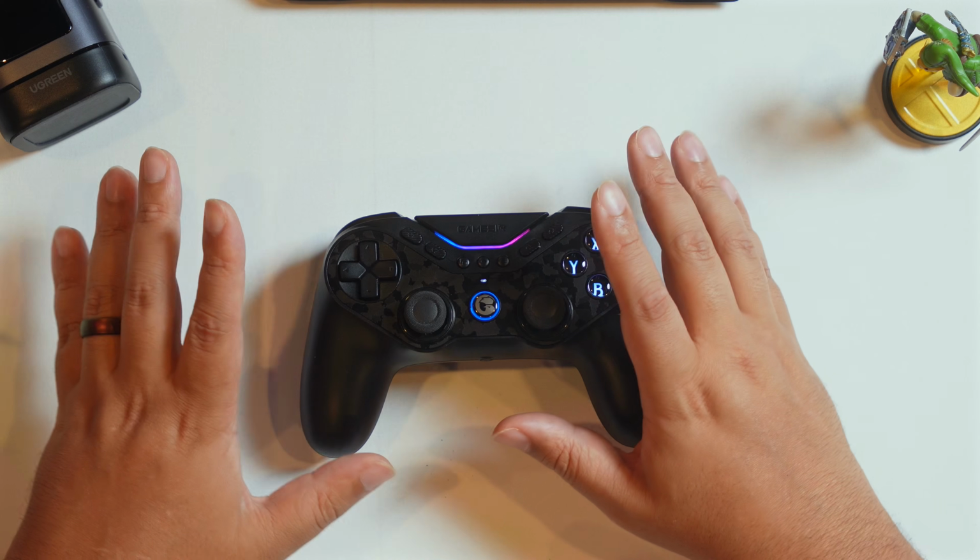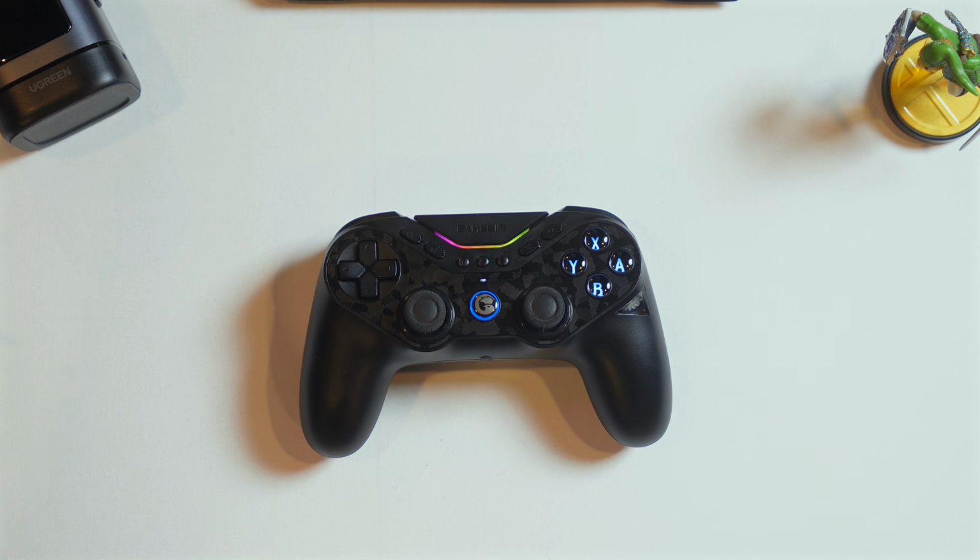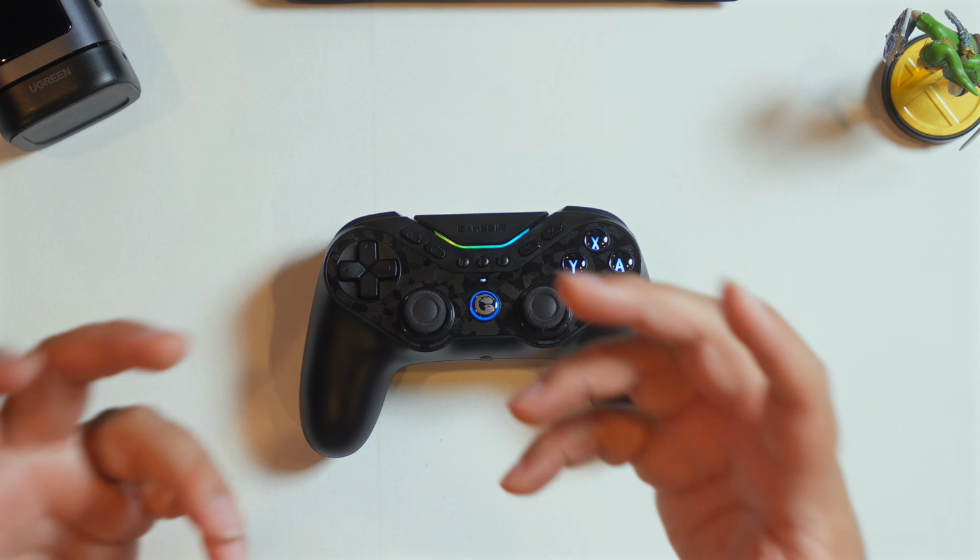Technically, it uses magnets, the exact same thing. But in terms of the triangulation of the magnet being read by the sensor, what you get is a very linear approach, a very linear growth to your sticks. Think of it this way. You know cell phone towers? How they triangulate your cell phone and they can know ballpark where your cell phone is? Well, imagine Hall Effect and TMR being exactly the same thing, but TMR has way more power, enabling your sensor to pinpoint exactly where you are with a much higher degree of fidelity.